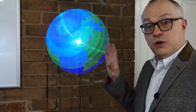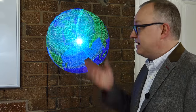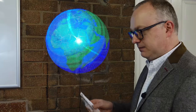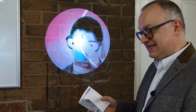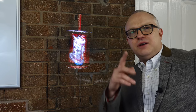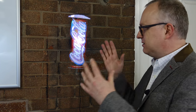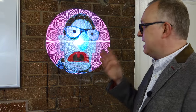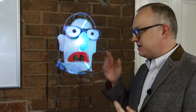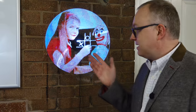Round images are good as well - if you get a square image and crop the top and bottom off, it's not as pleasing. A globe is ideal. I've got this GIF off Wikipedia; this one has 300 images in it and takes 30 seconds, so that's 10 frames per second. As for resolution, according to the manual this thing has 224 LEDs and does a resolution of 450 by 224 - I suppose they're including the persistence of vision effect there. On the camera monitor I can see the propeller effect in the middle spinning around - it looks like three or four blades - but I can't see that looking at it directly. It's just down to frame rates.